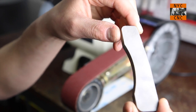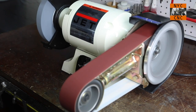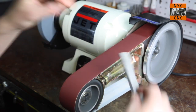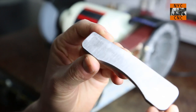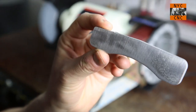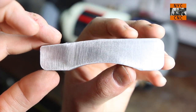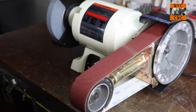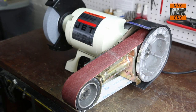So you've seen the surface finish of the part we're starting with. Let's flip it on. Just once really quick over it and you can see — not bad at all. Looking good; you can see a little bit of reflection already. I'm going to do the other side with 100 grit too, just to get both sides roughed in. Okay, we've got both sides roughed in with the 100 belt.